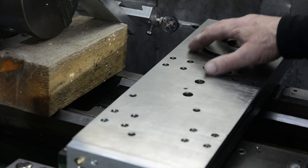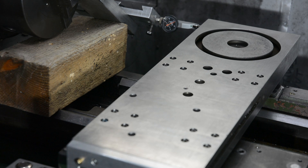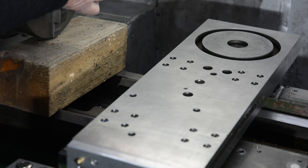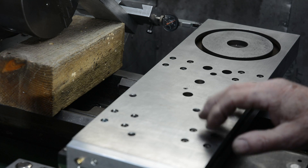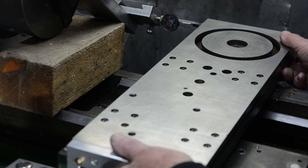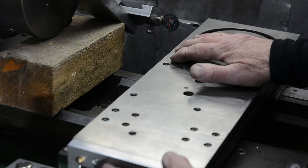It's time to do the alignment of the cross slide itself, bolted onto the four trucks that move with the slides. I've got the indicator mounted up, connected back to the chuck so it can be rotated around and indicated on the other end. At the moment I've got this just bolted down very lightly, and because of the clearance between the bolts and the holes I've got a certain amount of lateral movement. That will give me an allowance for lining up before I finally tighten the bolts.